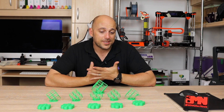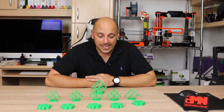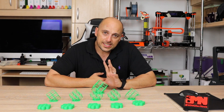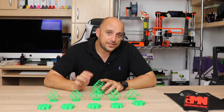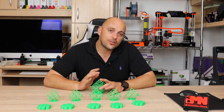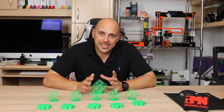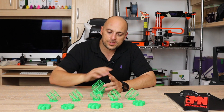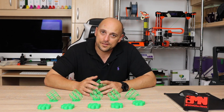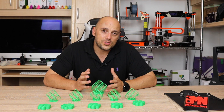And there it is — another shootout with a single fan duct. This was all printed in 3D Prints PLA green, all at 195 degrees, all at 0.2 millimeter layer heights. For the rest of the settings in terms of retraction, everything was written down and I'll leave them in the video description so you have an idea of what I used to print.